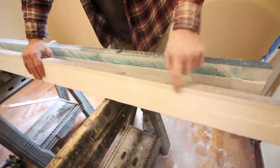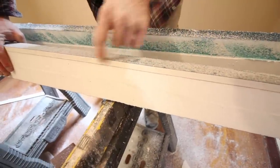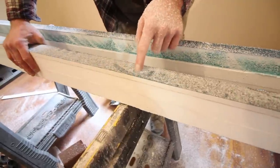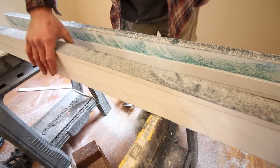You always want to have the hard curb. This hard curb is self-sealing. So this is going to be the top of the curb. Nice thing about this is that when you screw a shower door into it, the material on here will self-seal against the screw. So put the hard curb top on the top.